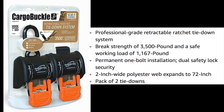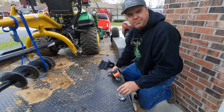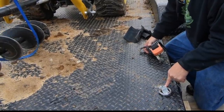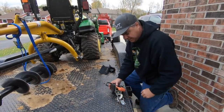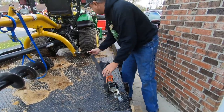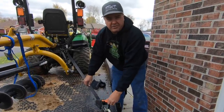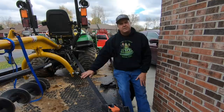Some folks have commented in prior videos that you can't use straps like this and must use chains instead. We've looked through the national laws and can't find anything that says that. Every item in the entire tie-down configuration has a working load limit. This D-ring says it has a 5,000 pound maximum breaking strength. The working load limit is one third of the max breaking strength, so this D-ring has a working load limit of 1,667 pounds. Same with the chains — each hook, pin, and fitting has a working load limit. I hook right up to the backhoe frame, which is the frame of the tractor. This cargo buckle has a working load limit of 1,167 pounds.